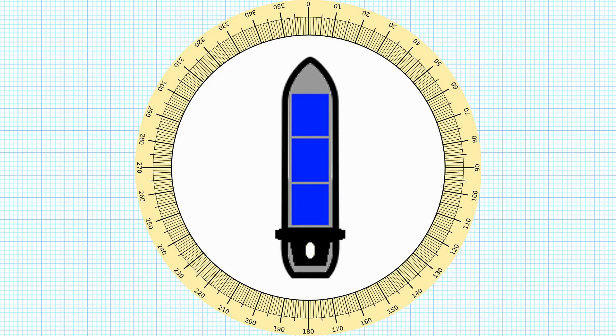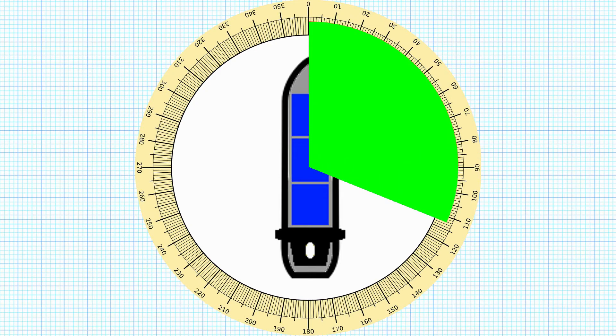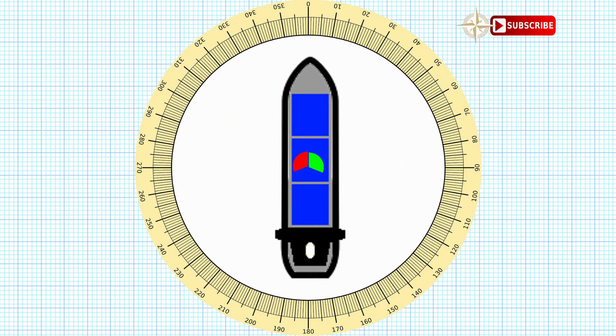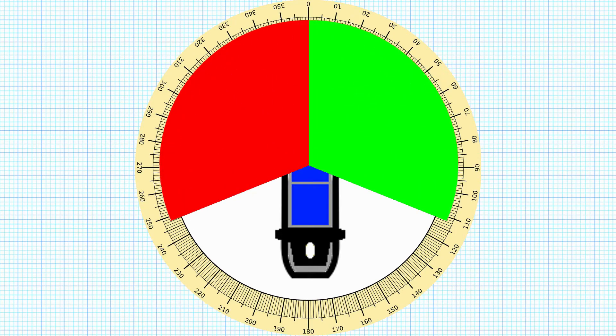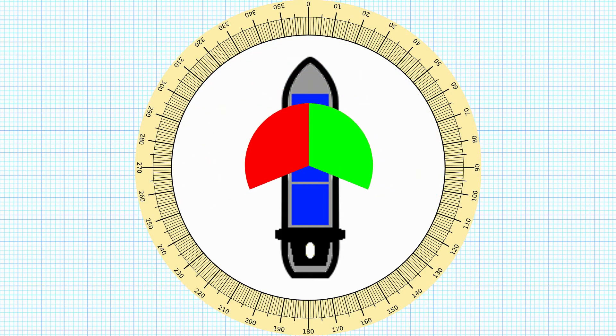Looking at it on the ship we can see the green starboard light goes from right ahead to two points above the beam on the starboard side and the red port light goes from right ahead to 22.5 degrees above the beam on the port side. When we're looking at them like this all I'm going to do is shrink them down and then we'll split them so they go on either side of the vessel where they would normally be mounted. If this was a smaller vessel we'd still have the side lights from right ahead to 22.5 degrees above the beam but when we shrink them down we can keep them together in a combined lantern.